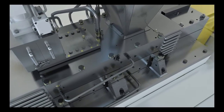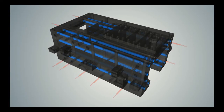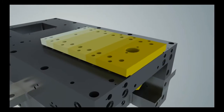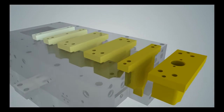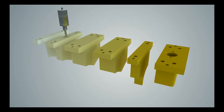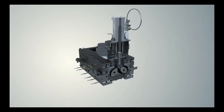The mixing chamber has provisions for heating and cooling, to facilitate heat transfer in order to maintain the melt viscosity for effective mixing. Specially adapted segments and dams can be used to create high shear zones and allow for secondary ports, used for sequential addition of additives, as well as an automatic venting device.